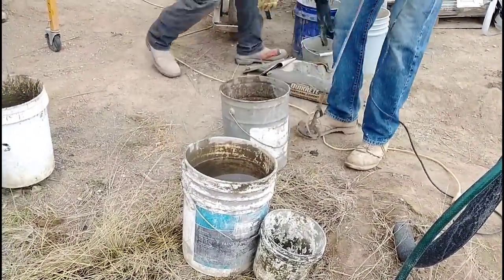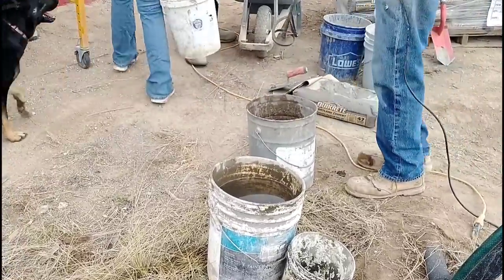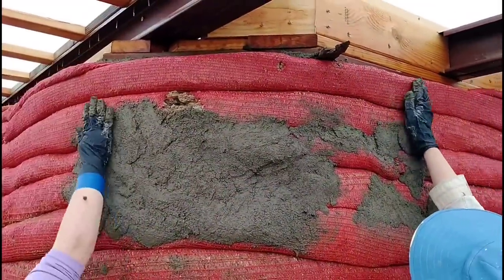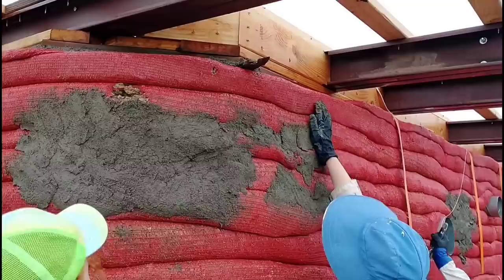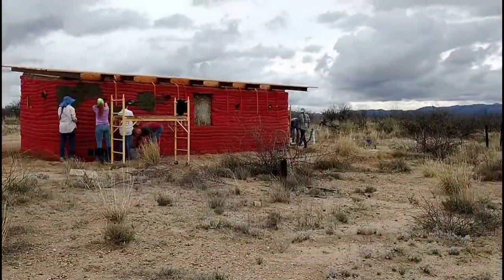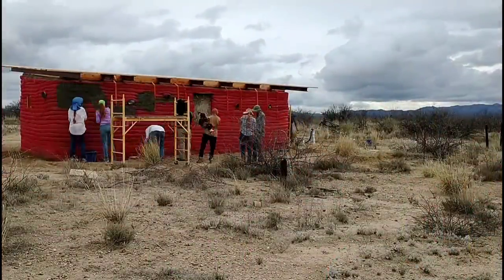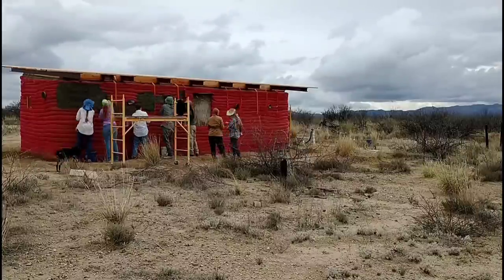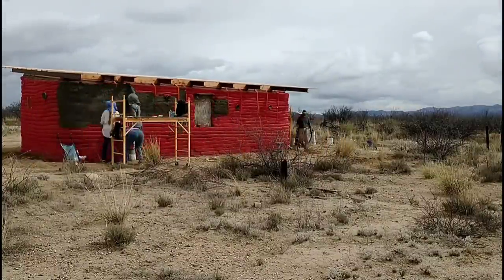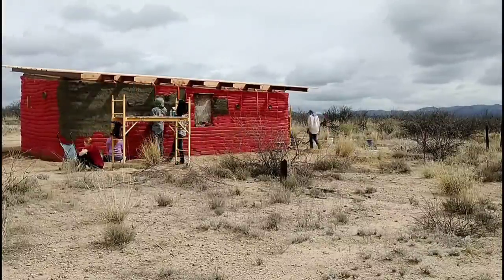We have quite a few people here helping with the stucco, so it's keeping one person busy pretty much full-time mixing new batches. Our daughter has experience doing stucco work on her place and it turned out very nice, so she's giving the rest of us instructions on how to go about it. We're applying this first coat by hand — it works really well to get the mixture nicely into the cracks. We wanted it kind of thick, and you also want a really coarse surface.